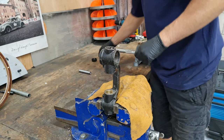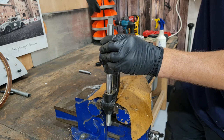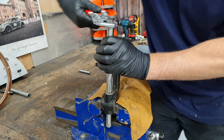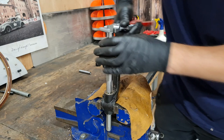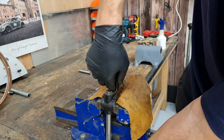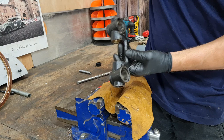Now we're going to cut through the bottom bush as well. We've cut the top bush using the bottom as a guide, and now we're going to cut the bottom bush using the top as the guide. A little bit more cutting oil — slide through the already-cut top bush fairly straightforwardly — and now we're down to cut our second bush. Using the flat pliers, gently applying nice pressure downward, now using our top bush as a guide to parallel cut the bottom. That's cut through nicely — no chattering on the face, it looks lovely. We've managed to parallel ream all the way through both bushes.